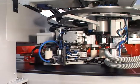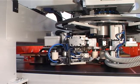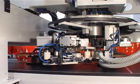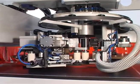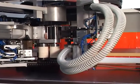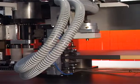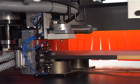The Vector Revolution 180 utilizes the principle of simultaneous processing and incorporates unique features which further enhance the performance of the machine. These include the sidewinder trimmer unit, which is mounted on the working head, allowing the gluing, edging, trimming, and glue joint scraping all to be finish-processed in one pass around the panel.